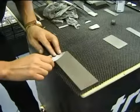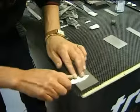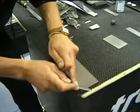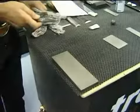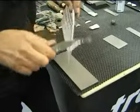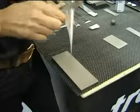Similarly, you can use this sort of thing for circular saw blades. We just go nice and easily, one side and the other side. And if we do this nice and slowly, on a fairly shallow angle, you're totally in control of what you're doing. So there's no need to whip it through or be fast, just let the diamond do the work. And even on one stroke either side, we really want to be going for an edge which is that keen. Now that is not just cutting the paper, that is literally gliding through it.